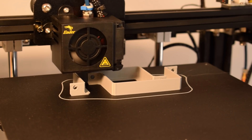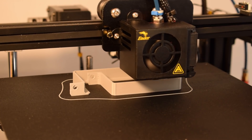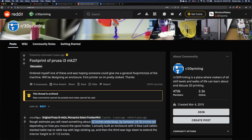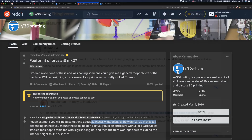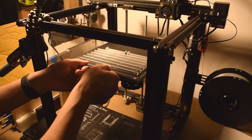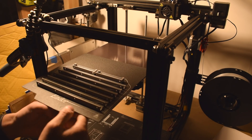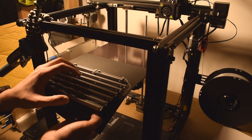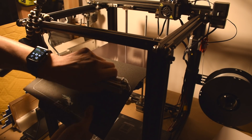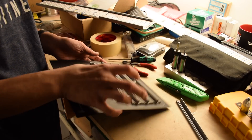Criteria number 2 was size. I didn't want anything with a build area smaller than 8x8 inches. But build area was only part of my size requirement — footprint was another big factor. My workbenches are all shoved up against walls, and space overall is very limited. I didn't want a printer that needed a lot of extra room in front or behind it. That ruled out big moving bed printers like the CR-10, so I was mostly cross-shopping the Ender 3 and Ender 5 families, as well as the Prusa kit. There were a couple nice things like the silent stepper driver in the Ender 5 Pro that put it over the Ender 3 and regular Ender 5 for me. I wanted to do as little invasive surgery as possible, especially with this being my first printer. I have no regrets.